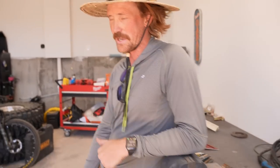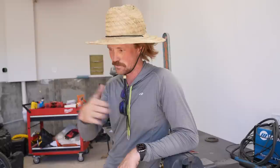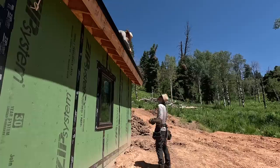Yeah, it's way faster and way cheaper to cut the fascia off over here, cut all the rafters back, four and a half inches I think was the difference, and then just buy a new 2x10, nail it on there for our new fascia, and then reinstall the drip edge and use the panels that we have. That's just the easiest, cheapest, quickest way to solve our problem. It was my problem because I measured that roof and I measured this roof. And I was like, the other side's symmetrical. I'll just double the order. It's fixable. It's gonna be quite a bit of labor tearing that roof apart. So here we go.